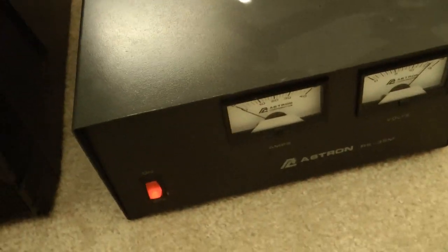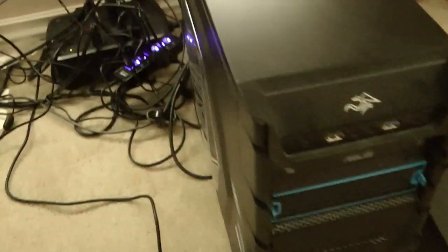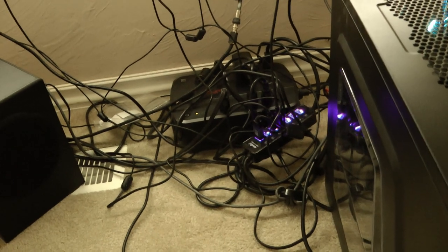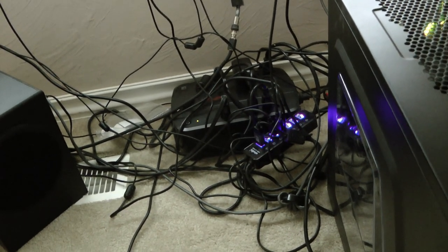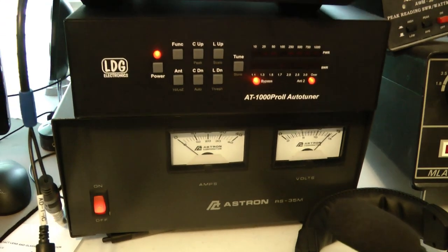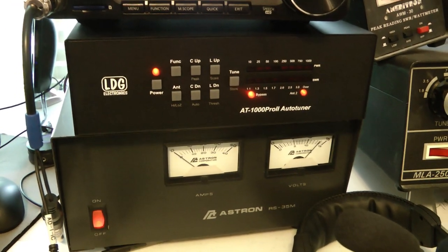The question is, I'm not the most organized individual. I have my power supply right next to my computer, and then I have wiring. Does that look like a nightmare? So what I'm going to try to do is isolate the noise from the computer to my radio. I moved my power supply up, but that didn't seem to make a difference at all. I still had noise.